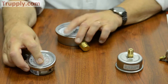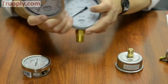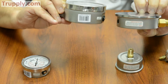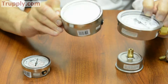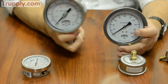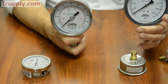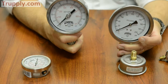If we look at a 4-inch PFP, you'll see a significant difference. Here's the PFQ and the PFP side by side — you can see just the heftiness of the PFP is much greater. It uses a full-size movement and Bourdon tube. The accuracy of the PFP is 1% full-scale, while the accuracy of the PFQ is 1.5% full-scale. So there's definitely a difference.